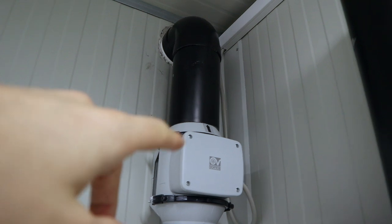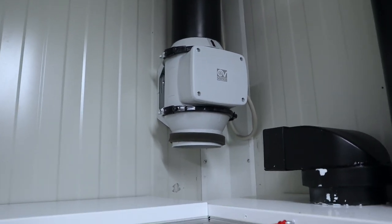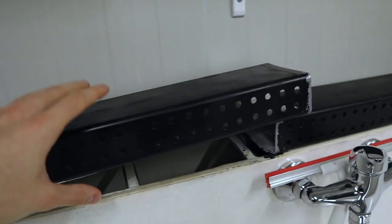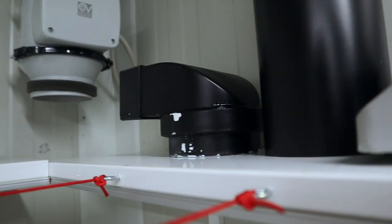As I mentioned at the beginning, I also have to fix my ventilation system in the darkroom. There are obviously some parts missing here because I installed my ventilation before my sink was in place, so some parts just don't fit together anymore. This is an inline fan right here that pulls the air out of the darkroom. There are some parts missing — this black pipe and this adapter that gets attached here — and the second part of this pipe doesn't fit anymore. I have to cut this one a bit and move everything a little more to the right so that the adapter can fit on and go straight up into the inline fan.